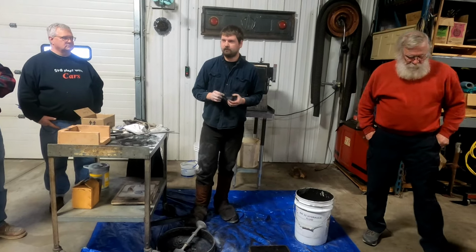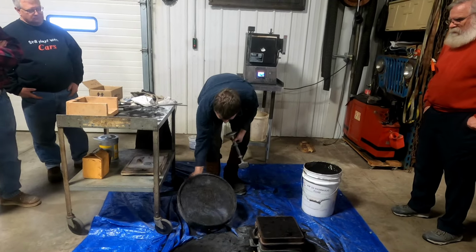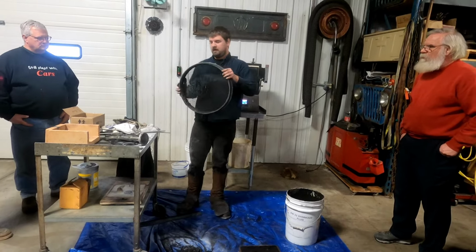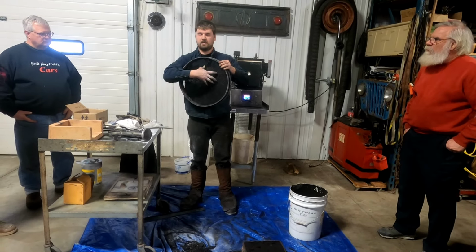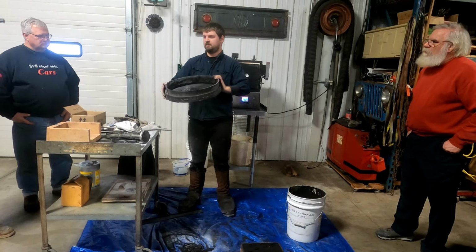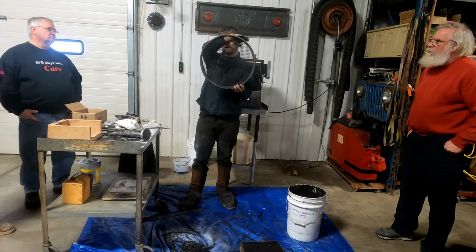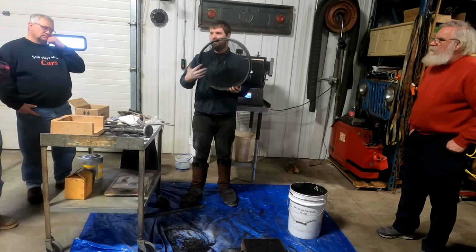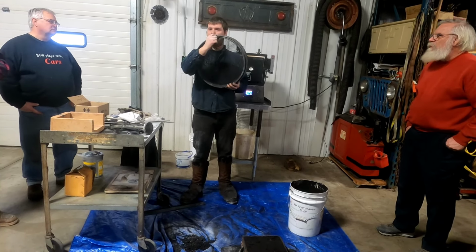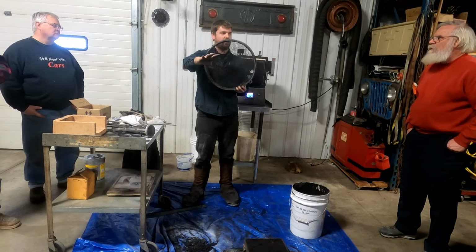So, when you have an undercut, and you can't get the sand in there, so again, we'll use the riddle. If I was gonna make this as a pipe, and I have to get this giant cavity on the inside, and I'm not gonna make it like this, I'm gonna make it like this, my green sand mold and my flask is gonna go over the top and the bottom. But if I pour that, I'm gonna get a solid cylinder of aluminum. I want a hollow cylinder with just a wall, right? A pipe. So I need to put a sand core in the center that runs across.